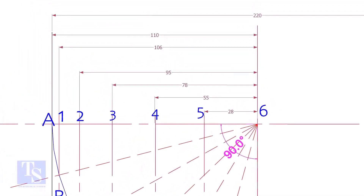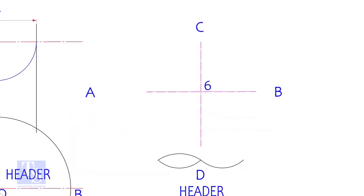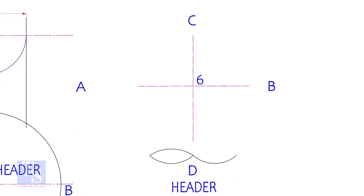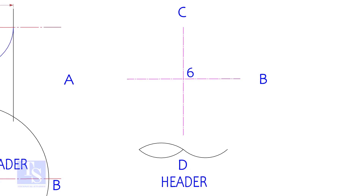You can either mark the RF pad on a plate or on a pipe, as per given in the drawing. In both cases, the marking method is the same. Draw lines AB and CD on the header pipe — watch the direction of the pipe. The short axis shall be parallel to the longitudinal axis of the pipe.